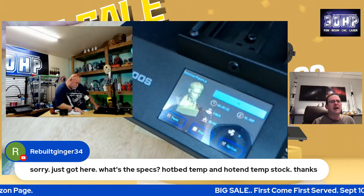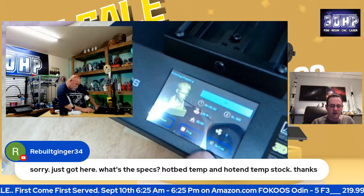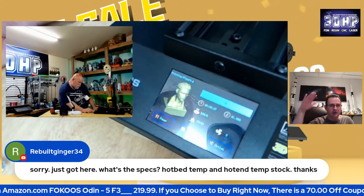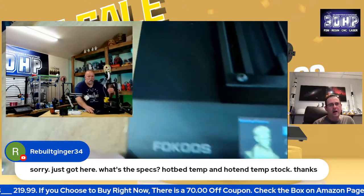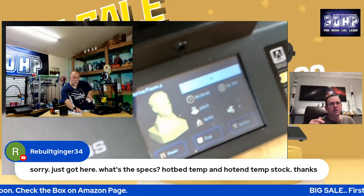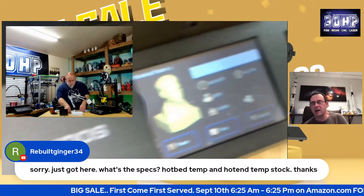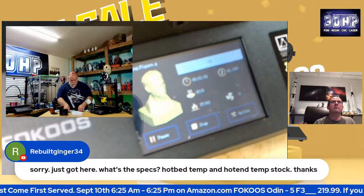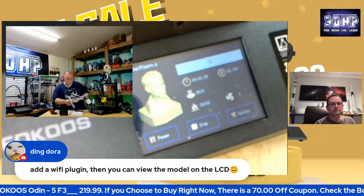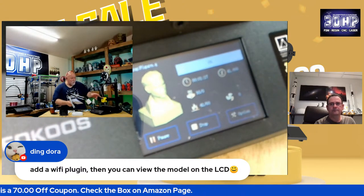When you slice your own files, there's a little add-on you need to add to Cura to make that work. So the specs, as you requested: it is the Odin 5S3 printer. It is 235 by 235 by 250 in Z. Dora, who's actually in chat, has said they have printed on this at 100 millimeters a second successfully with good quality. It's got a Robin Pro Mini mainboard with silent steppers — 2208 silent steppers. It comes with a manual that explains all the parts. It's kind of self-explanatory: tip it up, put in four bolts. Normally you've got to put in two ribbon cables, but those were already done for me.